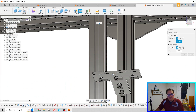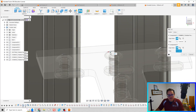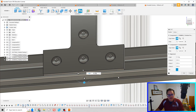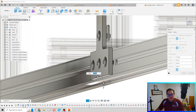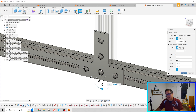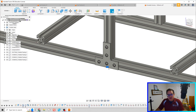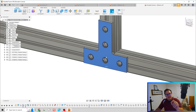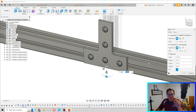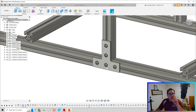I'll click on Joint and select a joint that I know is going to be easy to replicate — that's going to be the bottom edge of this T. You'll see why I'm choosing that in a second: it lines up really well with the bottom of this face here. It lines up perfectly, so I don't need to edit the joint. Looks good. I'll click Okay. Now let's make this joint active — it's a rigid joint, and I'm able to replicate this T-bracket with just a few clicks.